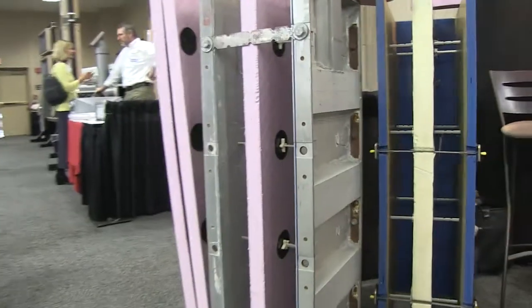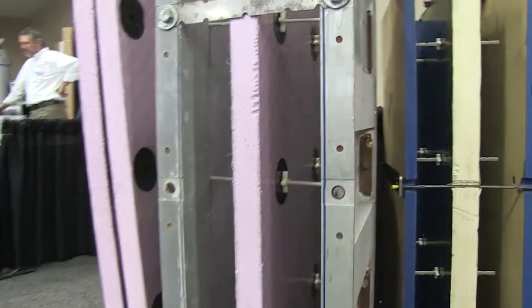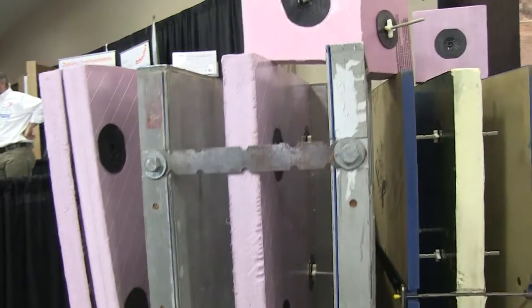Basically, you're going to have sheets that are supplied to you depending on your forming system. We can vary any of the three thicknesses here for the interior wythe, your exterior wythe, or your insulation, depending on what you need to accomplish structurally or thermally. A wythe is a thickness of a masonry unit — in this case, concrete is the wythe he was referring to.